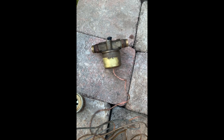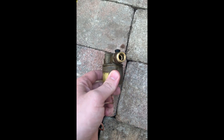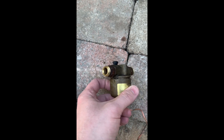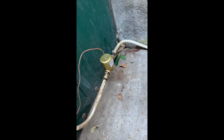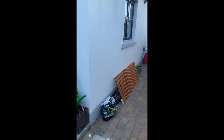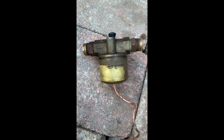The capillary fire valve turned out to be the offender — it was blocked. The oil was not flowing through it the way a new one, which is now installed, should. So if you're running a dual-fuel system — a boiler and a stove in the same property — you may want to check if there are any issues with running them both at the same time and not getting enough oil. You've got to check the fire valves.